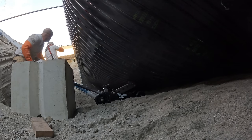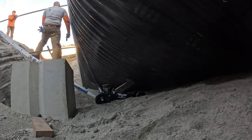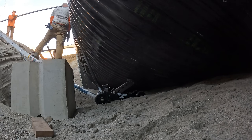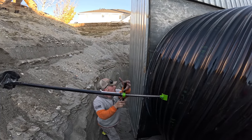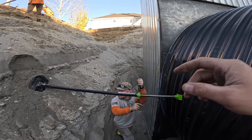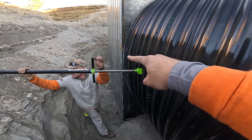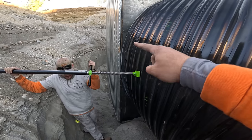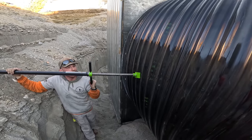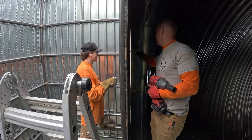Once the entry shaft was down in the hole, we did have to rotate the tubes ever so slightly to get them to line up with the entry shaft and our flange positioned on the flat surface of the metal plates, so the tubes can be bolted and welded together when we waterproof everything. And this jack stand is doing a fantastic job of ever so slowly shifting the edge over so it's flush. Watch this thin bead of light disappear, hopefully.